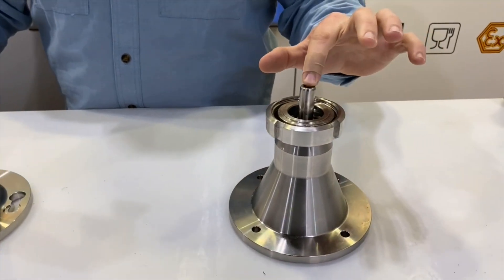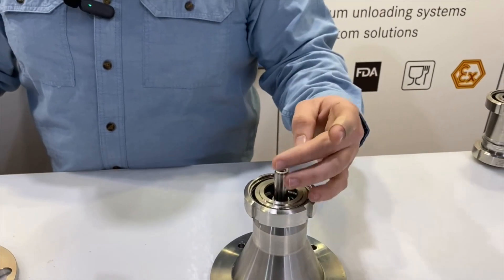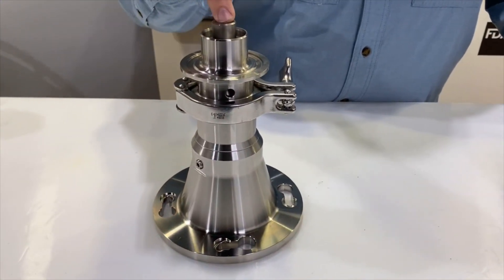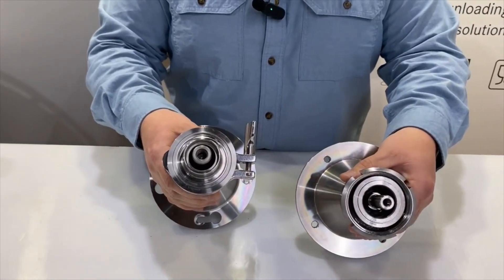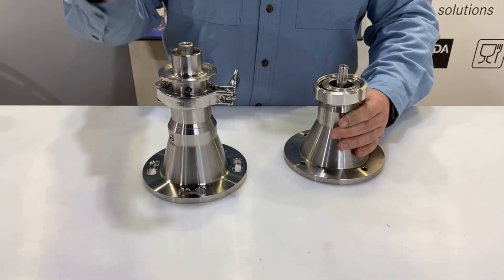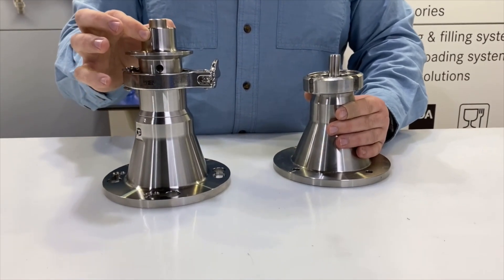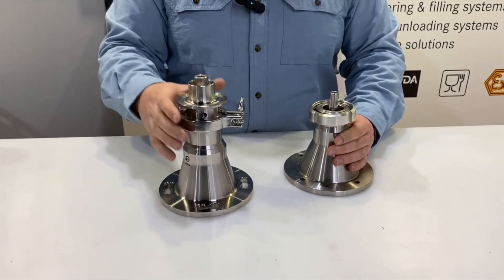Similarly for the bearing flanges of each style: on the 560 S, the gearbox shaft is threaded, the seal is installed, and the shaft threads directly into the gearbox. On the Visco Power, the shaft is threaded — it does have a larger thread than the 560 — and the seal threads directly into the gearbox drive shaft. With the extension on the motor connection piece, the seal sits lower and closer to the discharge of the pump, getting better lubrication from the product as it flows.